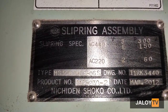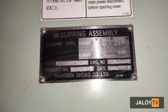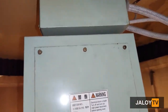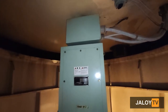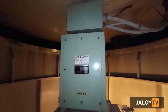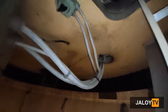A slip ring is an electromechanical device that allows the transmission of power and electrical signal from a stationary to a rotating structure. A slip ring can be used in any electromechanical system that requires rotation while transmitting power or signal. Physically, a slip ring is a continuous ring where a commutator is segmented. Functionally, slip rings provide a continuous transfer of power, signals, or data. Specifically, in AC motors, they transfer resistance to the rotor winding.